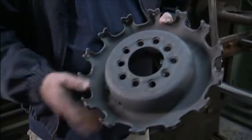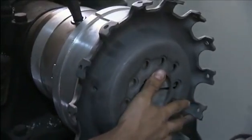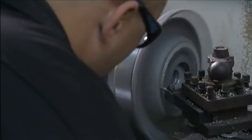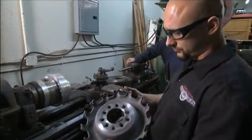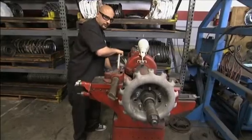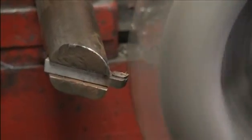When we make the artillery wheel, the first thing is we've had the center stamped, and we get like 1,000 pieces stamped at a time of various bolt patterns. The first step is we machine the back side of the wheel to make sure it's perfectly flat. We machine the outside to make it perfectly concentric with the bolt pattern, perfectly round so it has no hops in it.